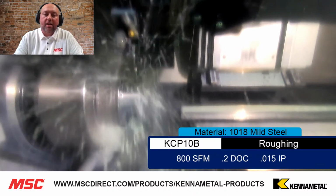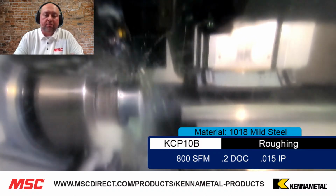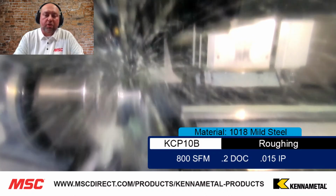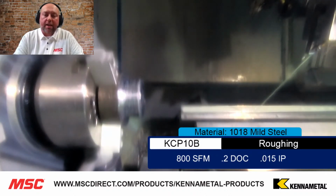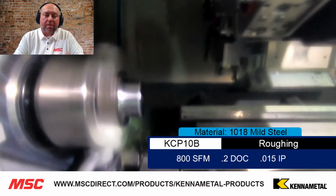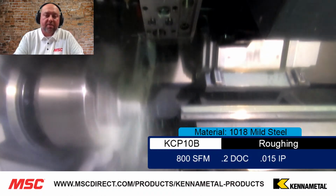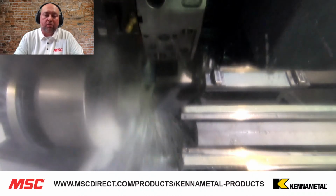And when we get to that finish, when you talk about producing the same quality of part, what we're going to be applying is the same nose radius of 31 thou at the same feed rate of 6 thousandths per rev. So we're going to produce the same quality of part in terms of finish, but we're going to be doing it a lot faster because of the higher surface footage and the higher metal removal rate.